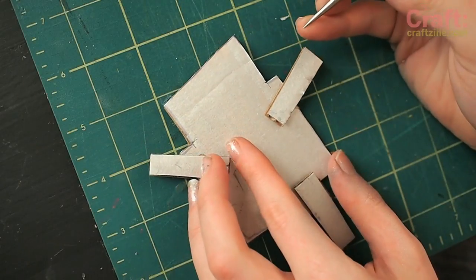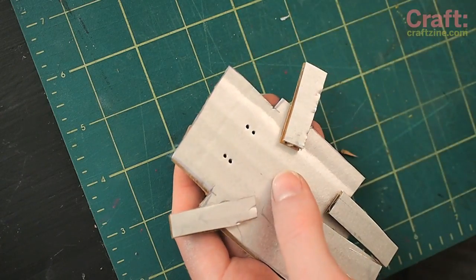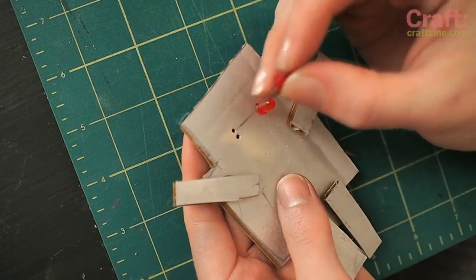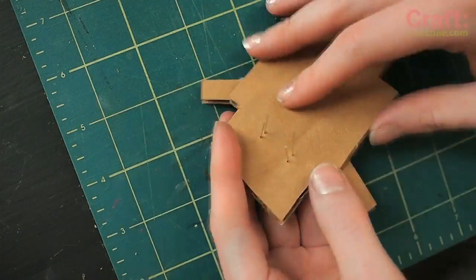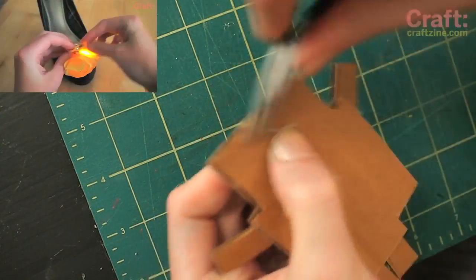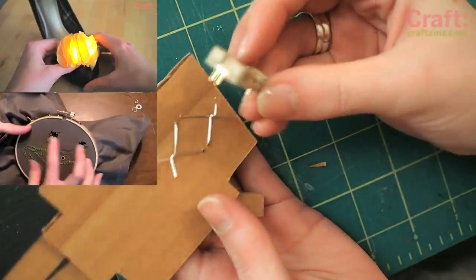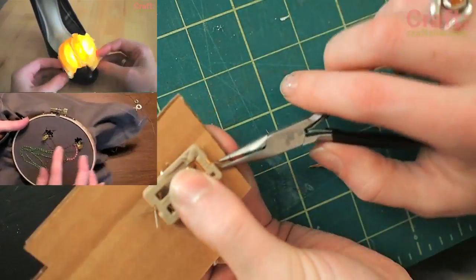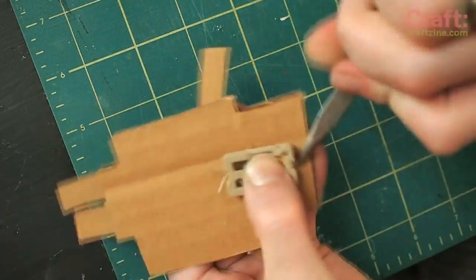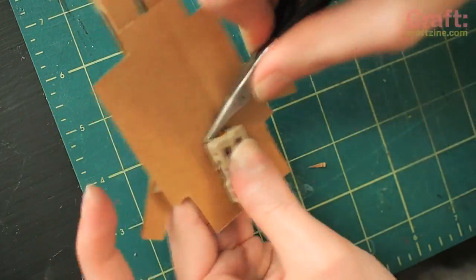Next it's time to add the LED eyes. Pick up a kit in the maker shed or use those LEDs you found when you swept up your workshop. Thread the leads through the cardboard. Tie both long leads together and both short leads together, much like LED shoe clips and LED firefly embroidery circuits. Add the battery connector, positive to positive and negative to negative. Wire the leads around the battery holder.